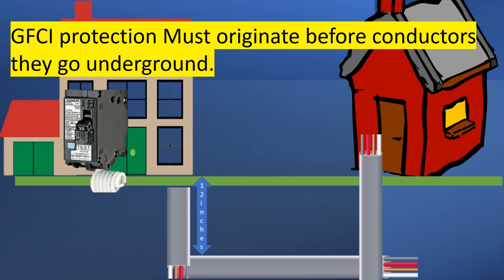There are a couple of ways to accomplish this. One way is with a GFCI breaker — you could put in a GFCI breaker at the origination of the branch circuit, and it would be code compliant. It would protect it all the way across and all the way to the outbuilding. Also, your outbuilding would already be required to be GFCI protected, so it would be taken care of for you. Another option is to use a GFCI receptacle and feed it off the load side — you bring the line side into the top, and off the load side you feed your underground installation. This GFCI could be located inside or outside depending on how you want to set it up. The key rule to utilize the 12-inch rule: GFCI protected before the conductors go underground.